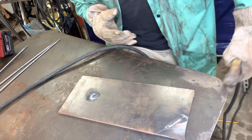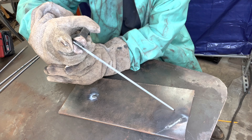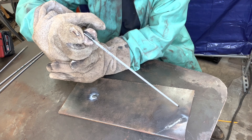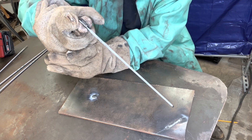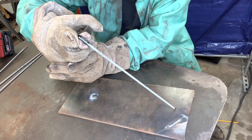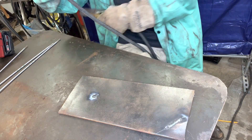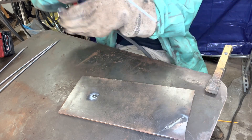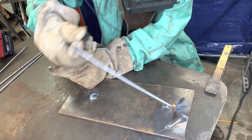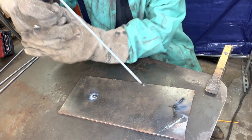A good way to practice — just practice, practice makes perfect. It's really not hard. Just a really gentle strike. You don't want to go way off your work piece because you're just gonna lose your arc. You gotta strike it really soft and stay close — about an eighth inch, maybe a little bit more if you're running really hot. Sometimes you're gonna have some problems with sticking, especially if you've never done it before. What I mean by sticking is when your rod just gets stuck to the plate. You gotta be quick and gentle, then hold about an eighth inch. And if you come off the plate too much, this is what'll happen — see what I mean by losing your arc?